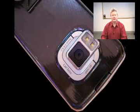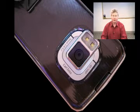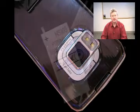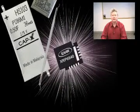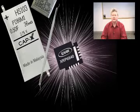LED-based flashes are particularly suited for portable equipment as they are small in size, low voltage, and low profile, and provide added flexibility such as torch modes. However, most portable batteries would need to significantly increase in size to support the 14-watt instantaneous power required by such a flash. Recent technology development in small form factor supercapacitors, combined with the XRP6840, provides a technical and mechanical solution to support a usable high-power flash function in a portable device.